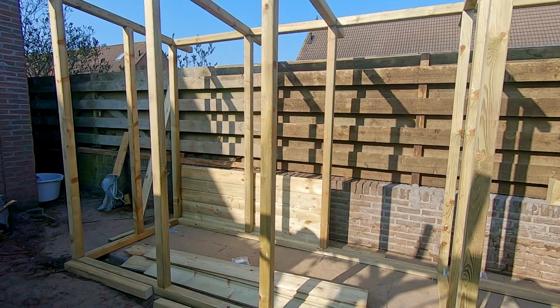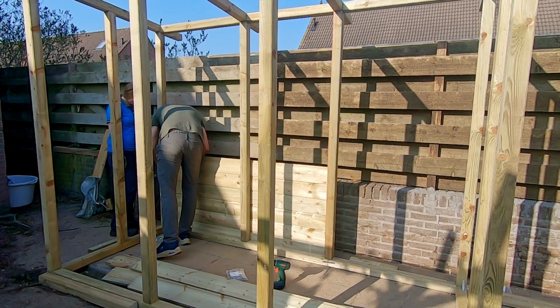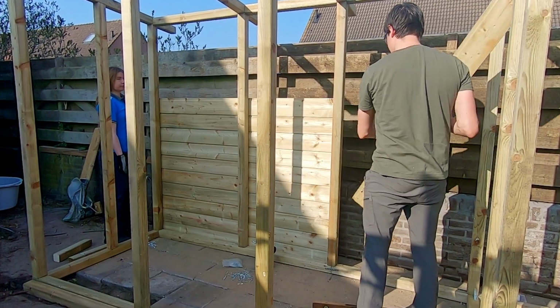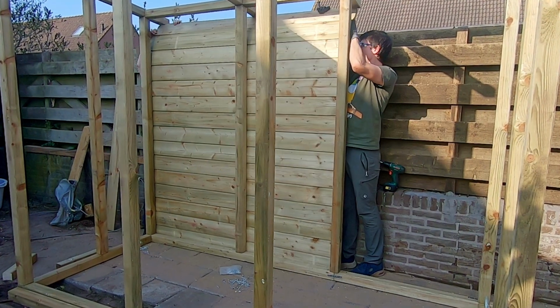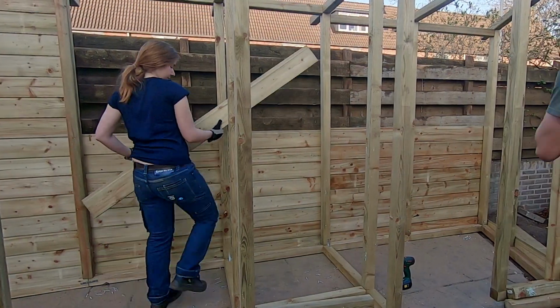The beams are a little less than 1 meter apart, so I don't have to cut the mesh, which is exactly 1 meter wide. I also planned this aviary in a way that the pre-cut beams or planks from the store were already at the right length. This saved me so much time, therefore the planks at the back could easily be installed with some help.